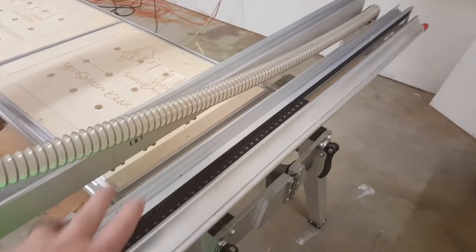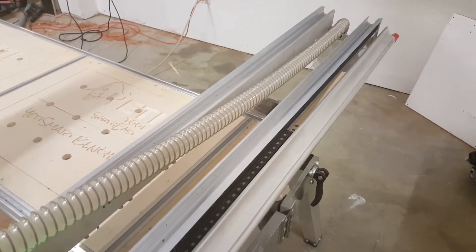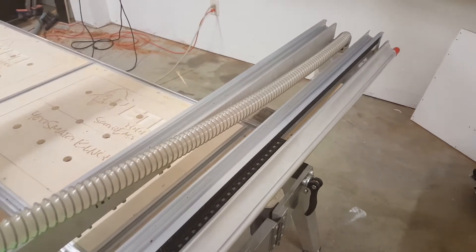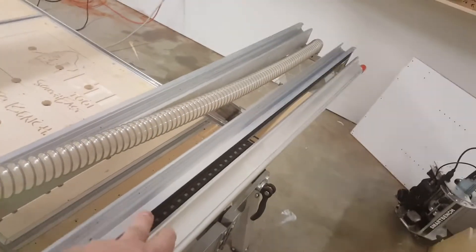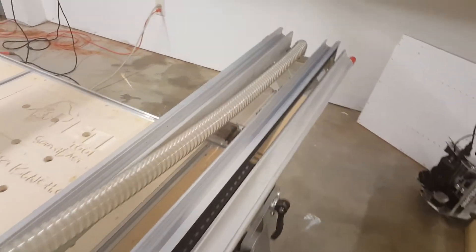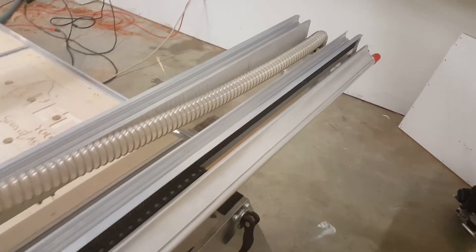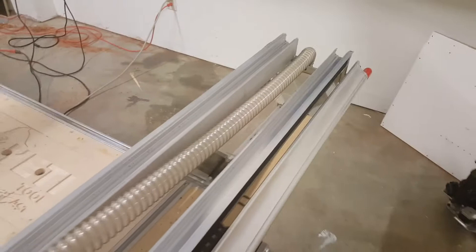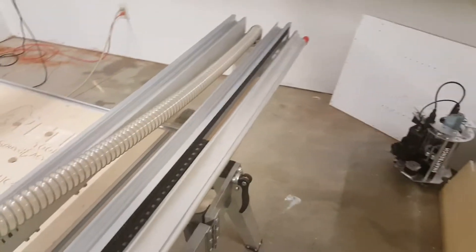A lot of this started because I was doing nested-based construction. If cutting at high speed with an 8mm bit or a thicker bit, you create a lot of debris. If that debris lands in your upper beam and you don't keep it cleaned out, you can have skipping because the wheels ride in this track as well. So the easiest way to fix that is to just cover it, and I'll show you some ways of doing that.